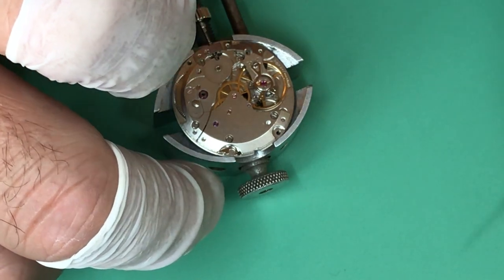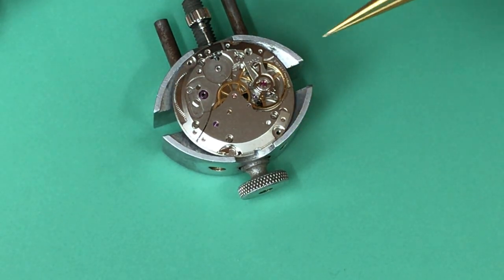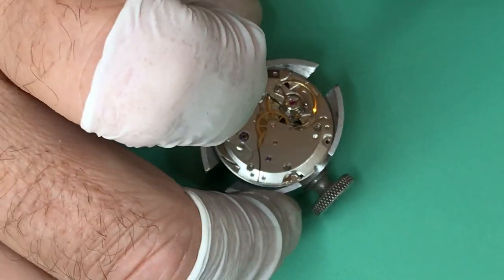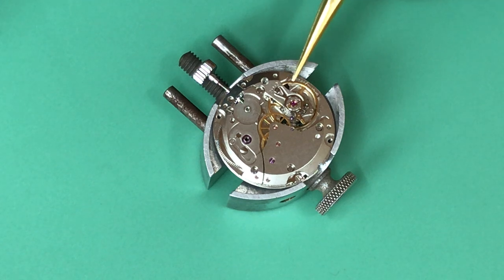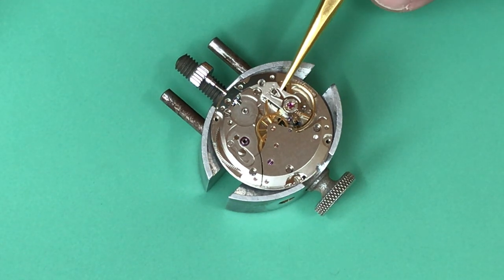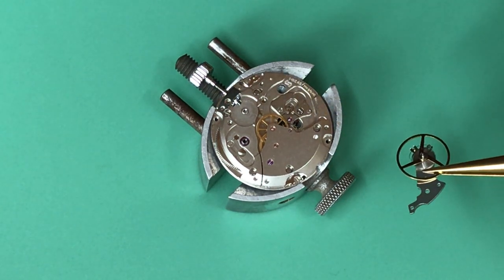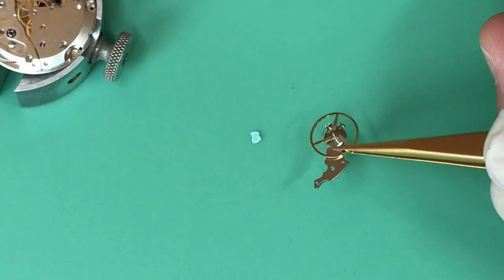and just pry a little bit. Try to get it up straight, because the pivots on these balance parts are very fine. I've never broken one, but I'm sure they break. People say they break really easily, so I'll listen to them. So you take that off. Now if you want, grab it under the wheel, just so the hairspring doesn't go flying everywhere. Grab it straight up, a little bit out. There you go. Easy as that. Not a problem.